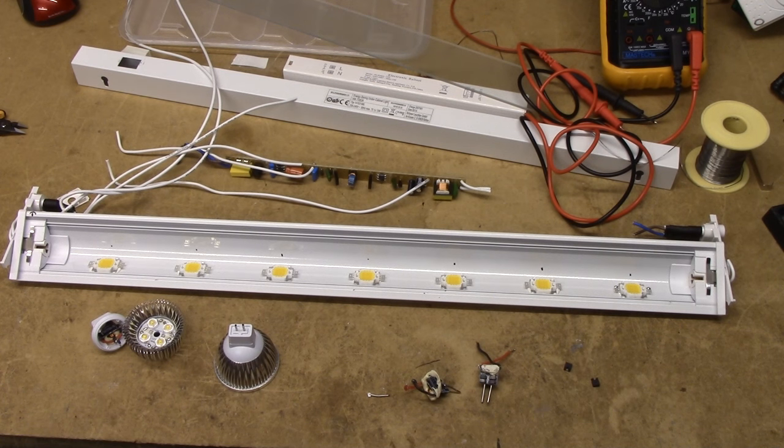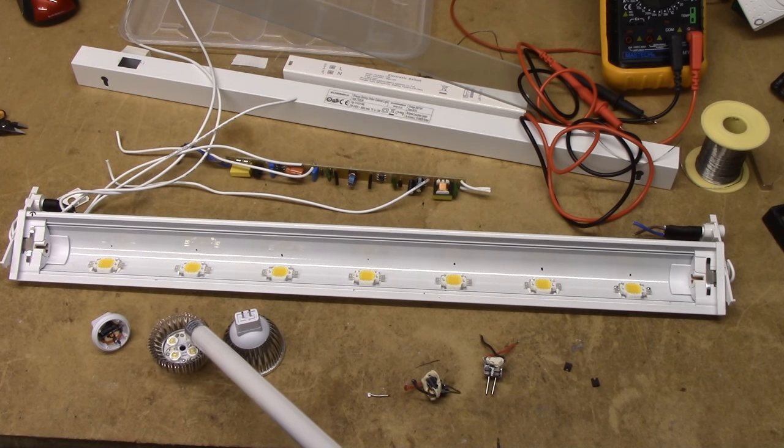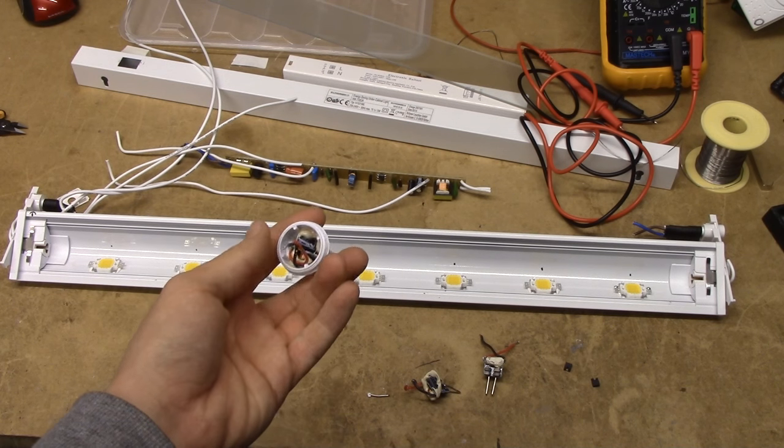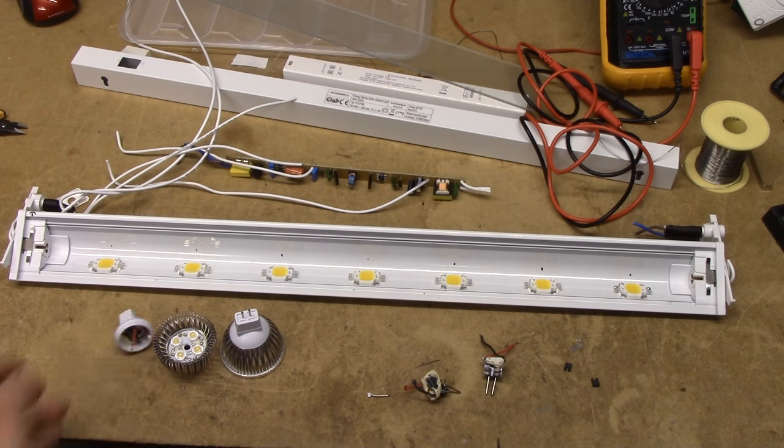What I furthermore intended to do was to just use a few of these 5-watt LED drivers that I've butchered out of these old broken 12-volt spotlights, which I got three of out of the trash some time ago. Because if you simply take a hammer to one of these, the driver will pop out very easily. These are 12-volt AC drivers, they rectify it to make it flicker-free, so they are able to run up to about 20 volts or so.